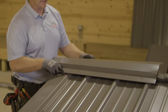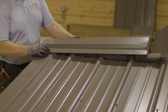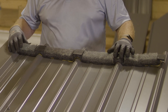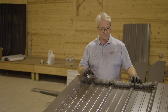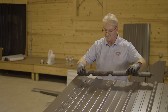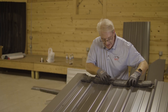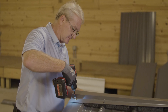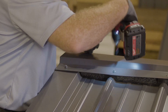What I always do is put the ridge cap down first, dry fit it, and make my marks. This is the LP Weathertight vented closure — we also have profile vent and inverse vent, but I tend to use this one a little bit more than others. There's an adhesive on it. I usually keep it back about a half inch from the line. We're going to be using two-and-a-half-inch screws to make sure we secure it properly.